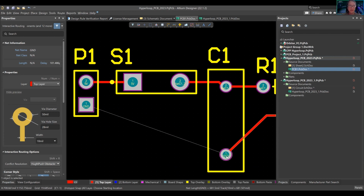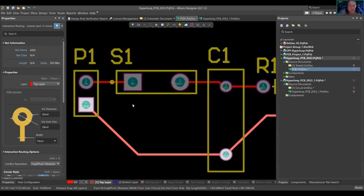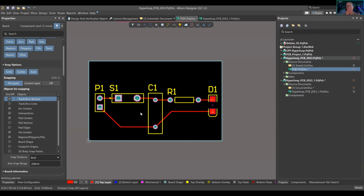Ground to ground. This is not a problem to do anyways, so we can do this. What I'm talking about is, for example, you want your ground connection, right? What I was saying earlier is that sometimes layers will be used entirely as copper for a ground signal. That means there's return ground everywhere. That means anywhere on the board, any signal can have a return path. So that's really nice. That's something to talk about later in the next conversation.